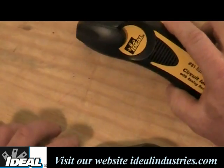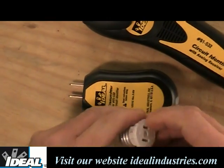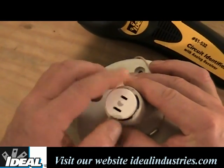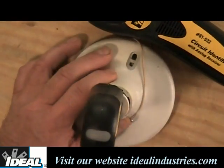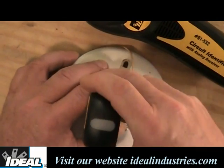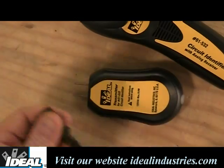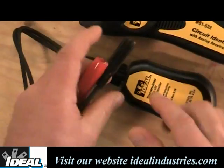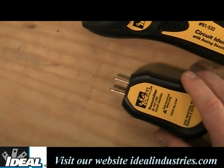When I look at the basic transmitter, it can be plugged into an electrical outlet in a room, easy enough. We also have — or you can buy — little adapters that we could use to adapt it into electrical lighting circuits. We can screw that into an incandescent lighting circuit and plug this right into the top of it. And if there was AC power, the light would be lit up and it would be generating that tone we're looking for with our receiver. We can also buy adapters that would allow us to clip it right to electrical wiring or bare conductors. But most cases it's going to get plugged into electrical outlets in rooms.